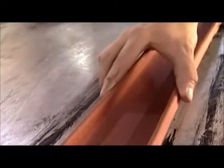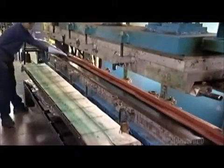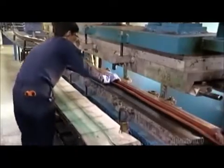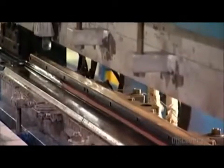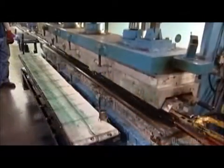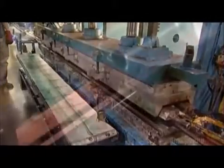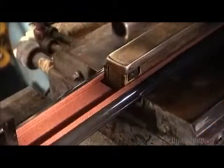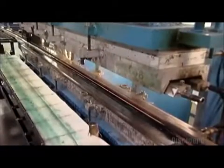Now the handrail has taken shape, but it's not strong enough, so a worker places it in a molding press. He positions a steel form inside the handrail so that it holds its shape. The top part of the mold lowers, and the handrail bakes under high pressure at 180 degrees Celsius. Ten to fifteen minutes later, the mold lifts and a chemical reaction called vulcanization has occurred. The layers have been laminated, and the handrail is now strong enough.